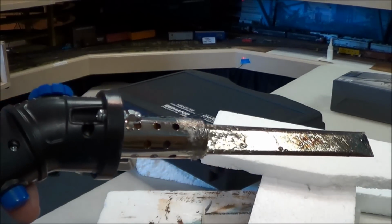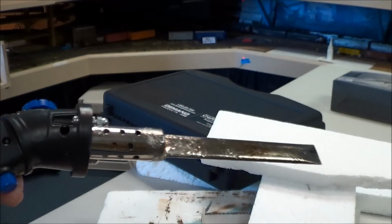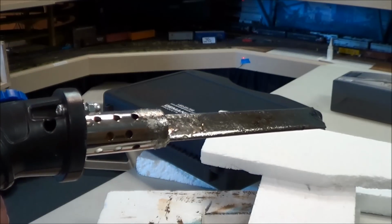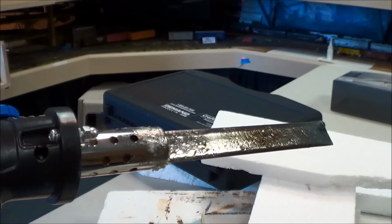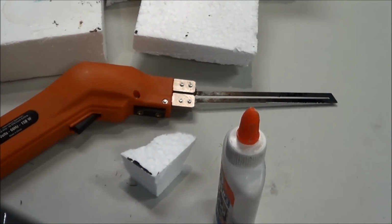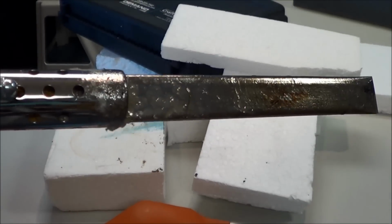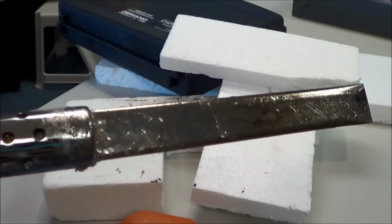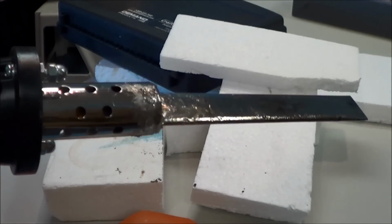And before I go any further, with these things, including your eyesight, you must have protective lenses and glasses on your eyes. I'll try to show you on the carpet down here what happens. But particularly in the case of this hot knife right here, it gets very, very hot. And it will melt the plastic. Needless to say, it'll burn your hand or skin like you wouldn't believe. So be prepared to use these.